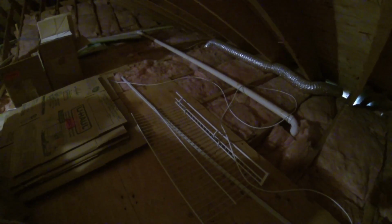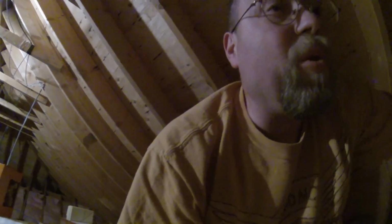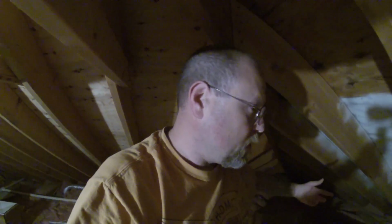And that goes to the second spare bedroom that is actually now my office for when I'm working at home, since my wife works from home all the time now, thanks to a pandemic. Who saw that coming? Anyway, I should have brought my flashlight, I keep forgetting this stuff. I was able to actually find the wall. Can't see down in there, but I was able to find the top cap of the wall, and I measured from the opening for the attic. I measured across this way to that spot, drilled a hole, found it on the first try, put the wire down there, cut a hole in for a new work box, or an old work box, and I was able to smash my head. I know it. I was able to find that wire and rig it up, and so that worked well.